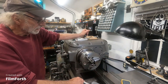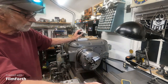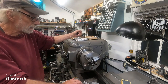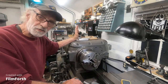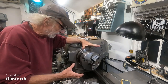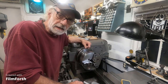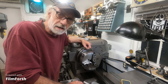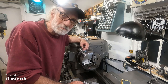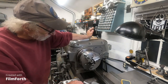Here's forward, and if you're tapping and threading, you want to tap in — see that? Isn't that nice? And it's just like the 10EE: in the neutral, it engages the brake. On the 10EE it is a dynamic brake, and on this it's a multi-disc brake actuated by 30 pounds of oil pressure. So we got forward, neutral, and reverse.